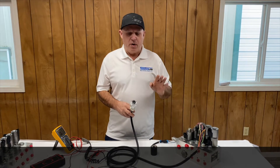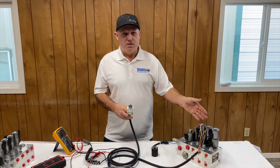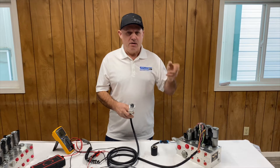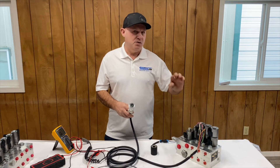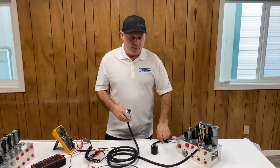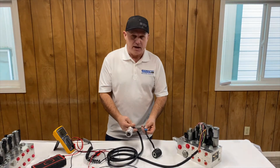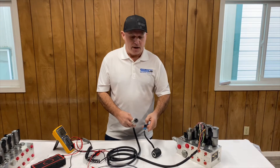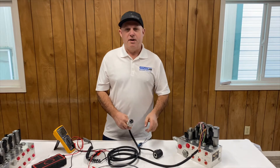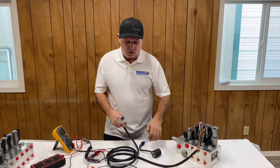Be very aware of that. On the coils we use — we usually use Hydroforce coils — they have a diode, a two-way Zener diode in there. The beauty of that is you can actually reverse-polarize them and it won't smoke the diode. But on the Bobcat coils you have to be very careful: make sure you hook the ground to the black wire and the 12 volts to the white wire, otherwise you're going to see smoke coming out of there.